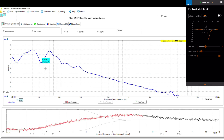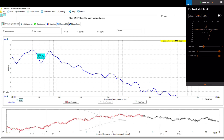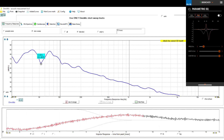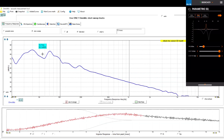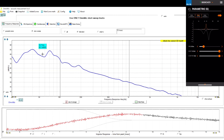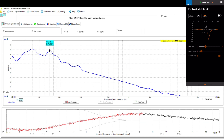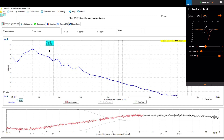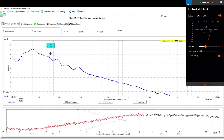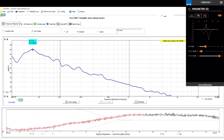Starting with the SB3000, I targeted around 52 Hz. I'll turn the PEQ on — as you can see, it brought that frequency up considerably. Then moving to the 70 Hz tone, because now you have a bump there, so we're going to cut that frequency down for a gradual slope. That leaves about 40 Hz where you have a peak.